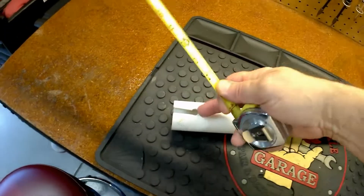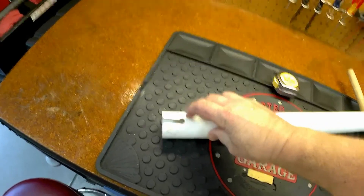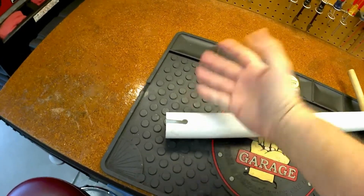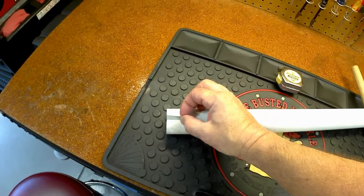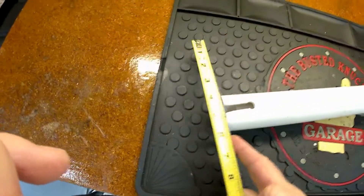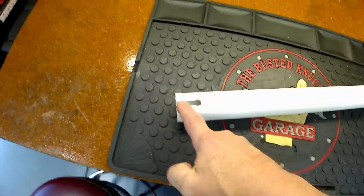What you want to do is drill a round hole at the top and bottom of the slot. If you just leave it square, it's going to have fracture points on the corners — if you put any stress on it, it can crack and come off. If you use a circle, it spreads the load and allows it to slightly flex without rupturing or breaking. So that's what I did.